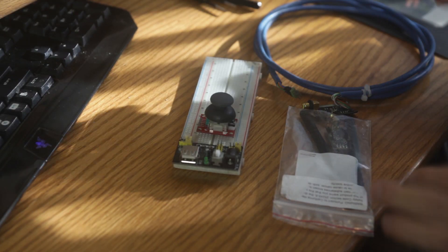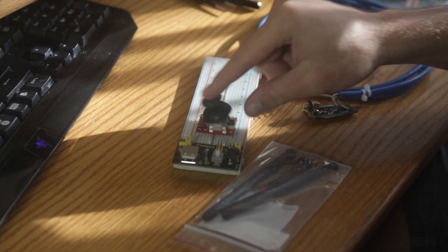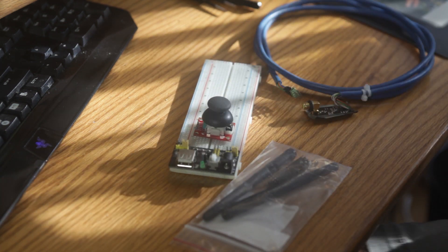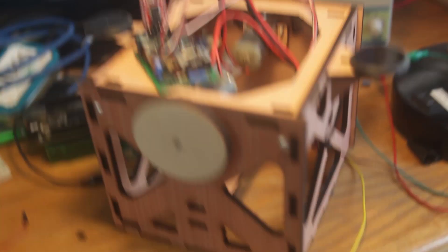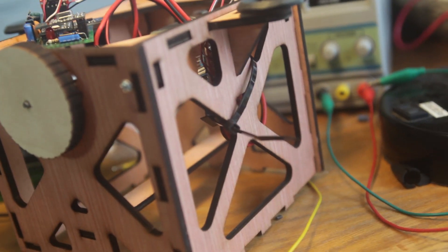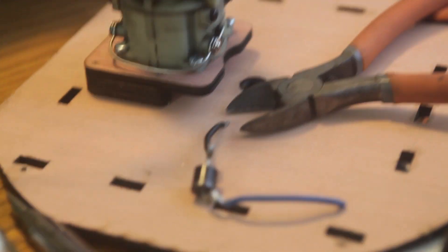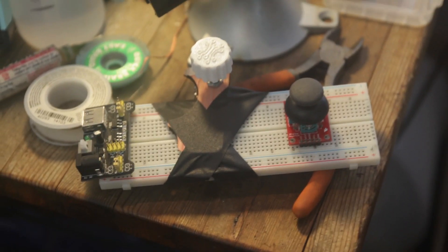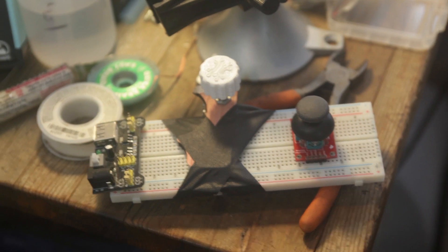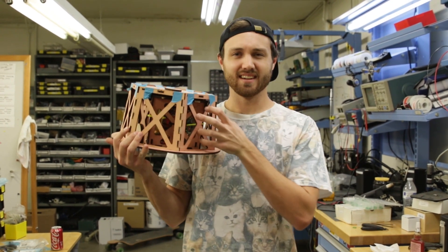I don't have any of the electronics done, so I pieced together some stuff I had laying around, and I could only find one joystick. I wanted tank steering — two joysticks that just go up and down. How am I going to mount the electronics? With zip ties. I wish I was joking. I am taking apart the drill controller so I can control it from the Arduino, and this is the big diode that prevents the motor from generating large voltage spikes and frying the electronics. This project went from zero to jank in about two and a half hours. This is going to be my remote control. It's done — I got it working here at the competition.